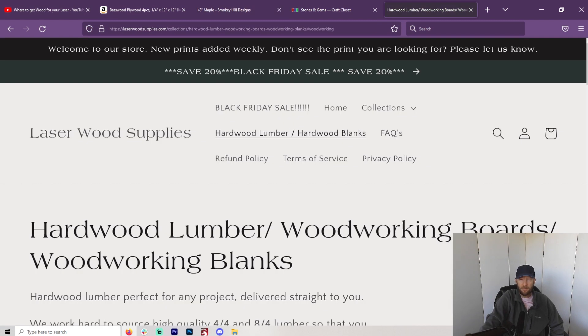I did want to mention that when you're first starting with your laser, go to a local lumber place, get the cheap stuff — eighth inch, quarter inch — and just practice. Like I did in my last video, use patterns and do testing with everything. Just test, test, test — get to know your laser and use the cheap wood. Make sure it does circles and squares correctly. You don't want to practice on expensive hardwoods. The more you know about your laser and how it cuts before you start testing hardwoods, the better off you'll be.